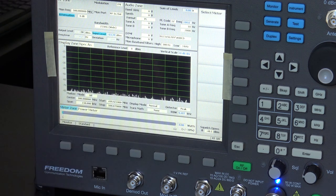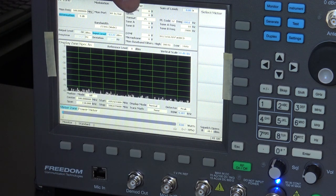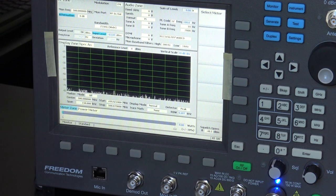You just heard me talk to a repeater on GMRS in Fort Pierce — about 25 to 30 miles from my house. Three watts is definitely usable. To be fair, you're only going to notice an increase if you double your power — that's 3 dB, half an S-unit. So going to six watts, you'd have to double it to make any difference. Going from three to six to twelve to eighteen — that would be a big step up. But at 3.15 watts on a five-watt claim, it still works.